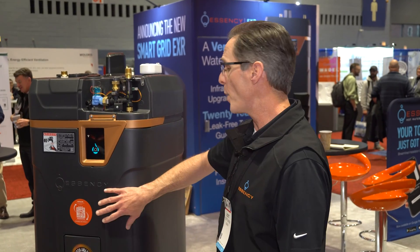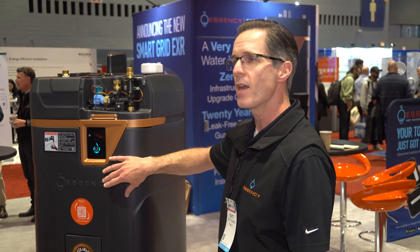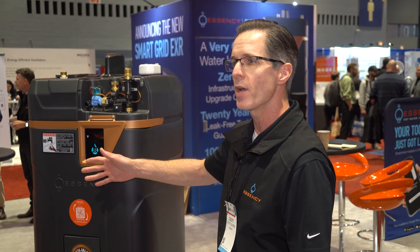So that's the key difference. Capacity is an interesting question — we store 55 gallons, but it's actually an 80 gallon water heater, upgradable to a 100 gallon water heater by changing the stored water temperature.